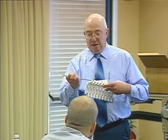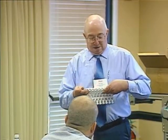Much easier to repair because we can pop that pin out, take out whatever rows of modules that are damaged, broken, torn, whatever the case may be, put another section in, drop the pin back in, and off we go. So you're up and running. You don't have to worry about coming in with a piece of material and putting a Dutchman in it, which is a short piece to take the place of the damaged section or what have you. And you're back up and running again with it real quick.